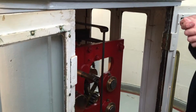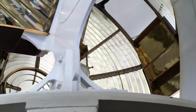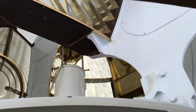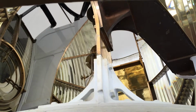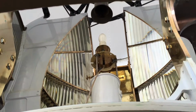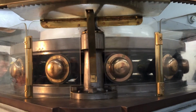Now, as everyone came up the tower just now, you'd have noticed some chains down the centre of the tower. On the chains, a large and heavy weight. So that's now descending the tower, the chain attached of course to the cogs, turning your wheels. If you look to the bottom left corner and follow the drive shaft all the way through to the lens that tops off the wheel, basically your lighthouse mechanism is a giant grandfather clock.